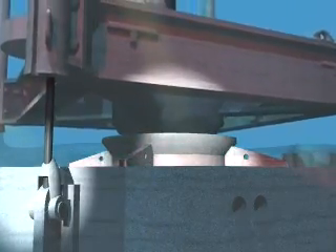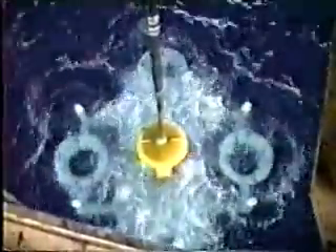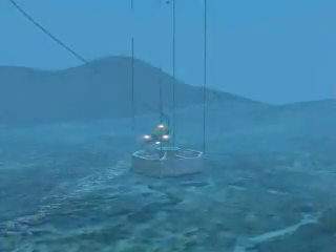In the event of contact between the PGB and TGB, the rounded gimbal compensates for a sloping seabed. The temporary guide base can alternatively be set on the seabed before installation of the structural casing begins, particularly if a hole is to be drilled first.